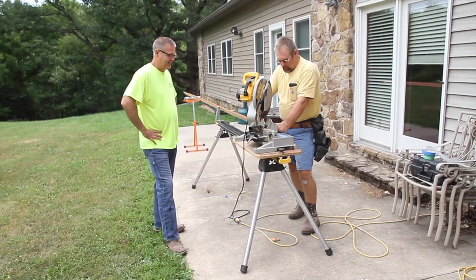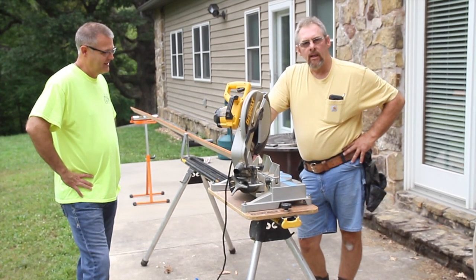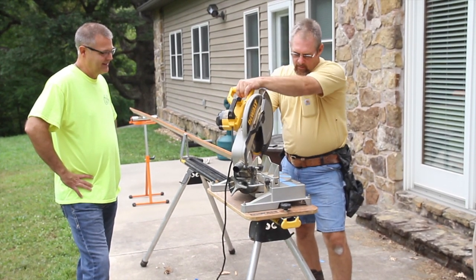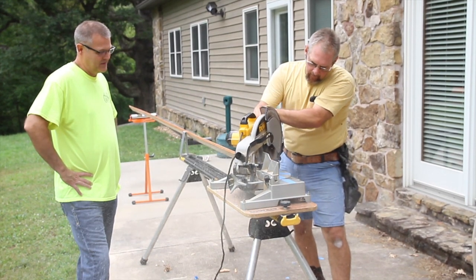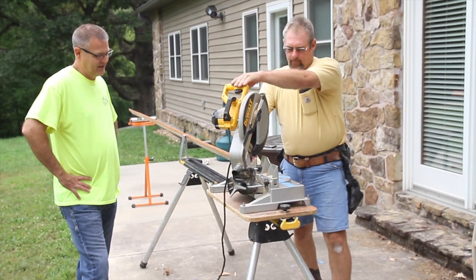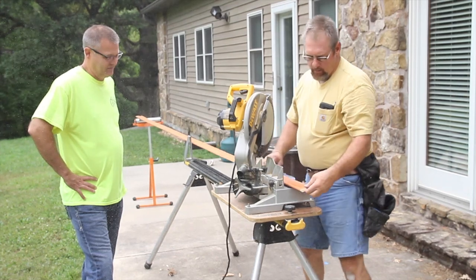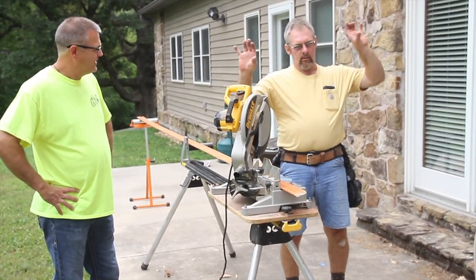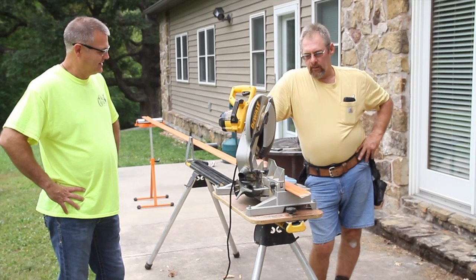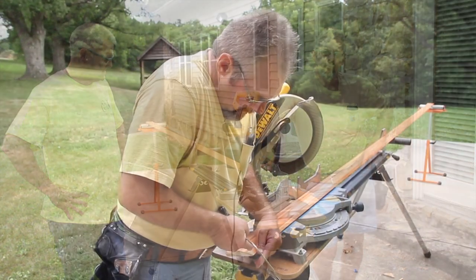Basically, the crown we're putting up, matching it up as best as we can, and putting it up against the ceiling area. Cut our edges backwards and upside down, backwards, to get our cuts right. And then miter this out, and when we go into the room, the two miters will come together and form the corner. And just follow it basically around the room. And we do the same thing on the base trim, get everything to match in and get everything ready to go.